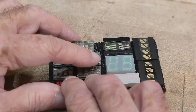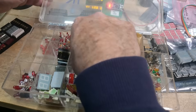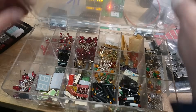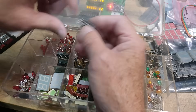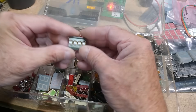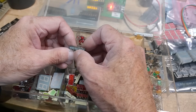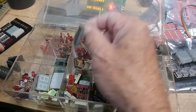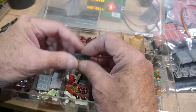I have another box of parts. I've got a box here of really old LEDs and some of these parts are in there. Here's another 2111. And then I have some more — these are Siemens 2437s. These are a bit different; they have the little fisheye lens on them and single die LEDs. Also a 2416, so these must be pin compatible as well, but a different type of display. Got a whole bunch of those — I must have picked those up while at HP. Here it's clear on the back so you can see the decoding die on the back, and the LEDs are on the front.